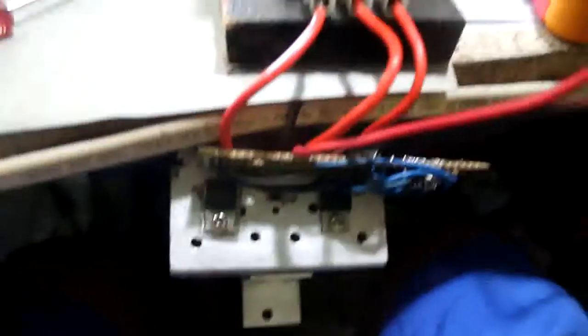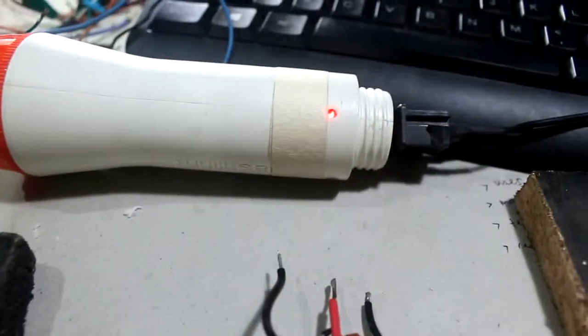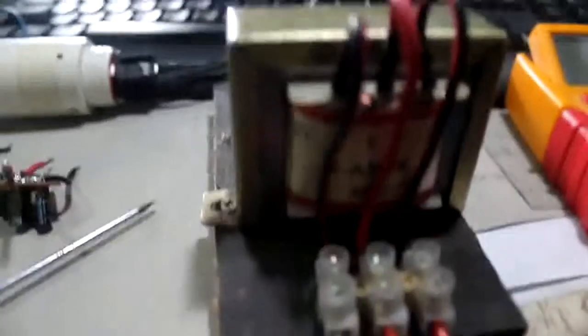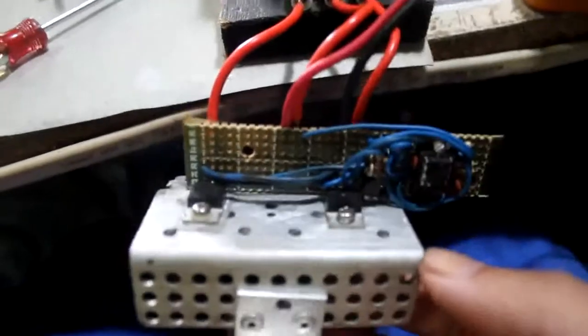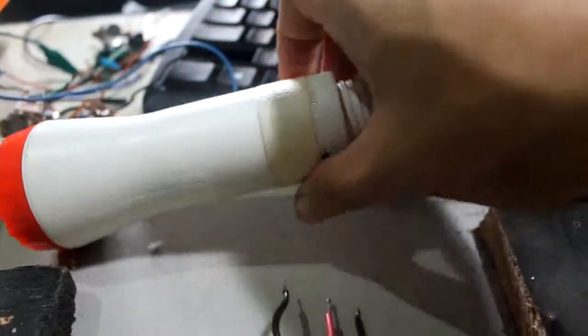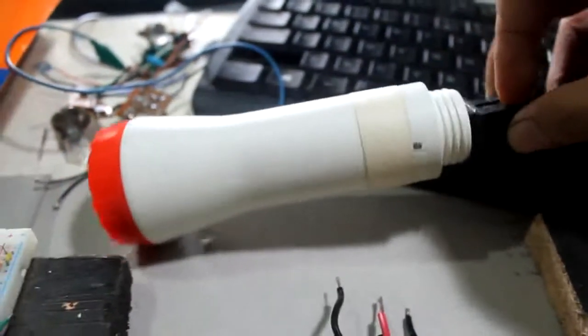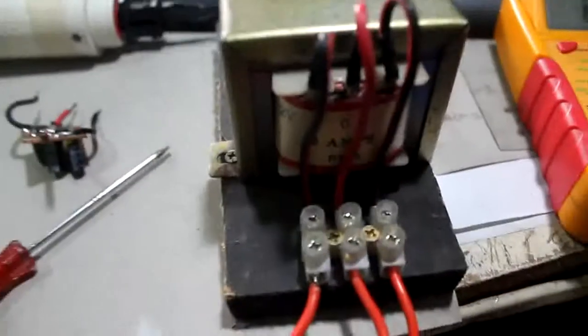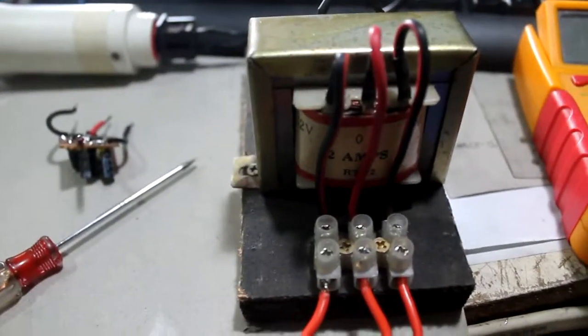So when this is on, like this one, and that is charging over there, the amps shoot up to 5.6 amps. Therefore, even though this inverter over here is an efficient one without load, when you use a capacitive charger like this one over here, it shoots up to 5 amperes or more. So it's quite a waste compared to the first one, the first candidate of our homemade inverters.